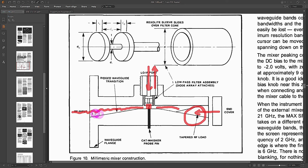The IF exits on the other side, and the ridge opens back up into a tapered RF load — an absorber — so the waveform hitting the end cover comes back and gets absorbed again. Nothing comes back out. RF comes in, squeezes into the junction, the LO hits the junction simultaneously, they mix due to the diode's nonlinearity, producing an IF signal that coaxially connects through the low-pass filter back into the IF line. The diplexer then separates LO and IF.